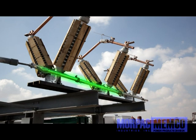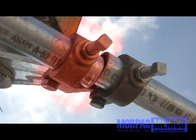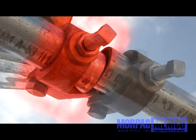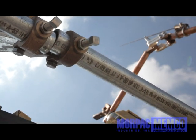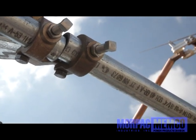In our installation, there is a hinge double clevis in the middle or second phase. Insert this pipe through only one clevis. Please note, this double clevis is unique to our demonstration and may not apply to your installation. The second or hinged clevis on the second phase will hold the second pipe going to the third phase. As stated, now insert, starting from the third phase, the second interphase pipe to connect the third and second phases using the hinged clevis on the second phase.